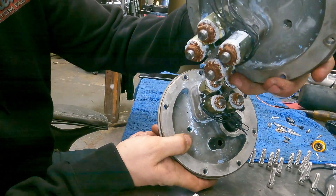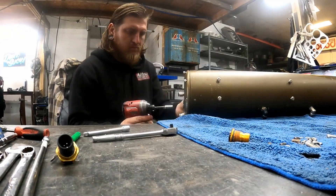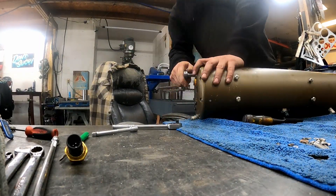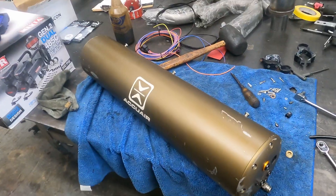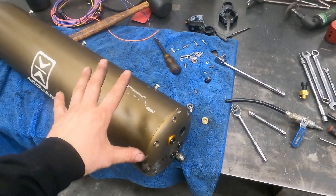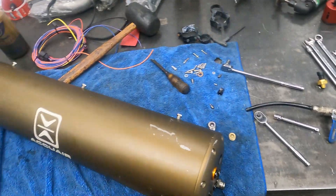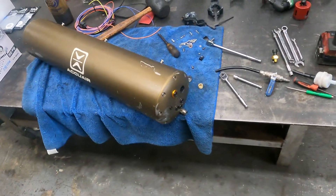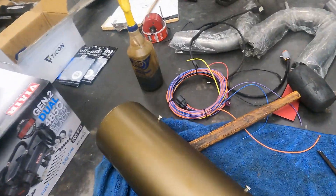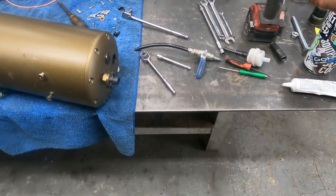There we have it — freshly converted CVT over to a VT tank. What that means is it's a valve-tank combo, so the valves are inside the tank. You're not going to have an external valve block. It's converted back to traditional VT, which is something Accuair continues to offer, so if you have any issues they do have that option. The kit also comes with a new pressure sensor, so we're going to add the new one in and you can keep the old one as a spare.